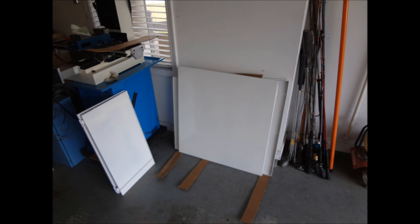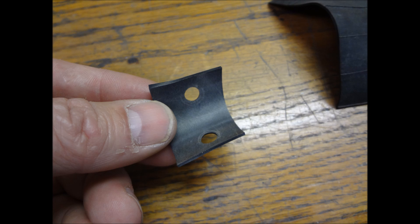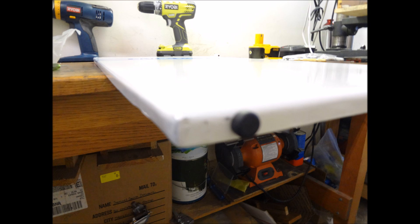This here is an inner tube from a bicycle. I cut some one-inch by one-and-a-half inch rectangles, folded them in half, and punched a hole with a hole punch. I used these as gasket material for the side panels where the bolt holes went through, so that everything would seal up nicely. I also installed some rubber bumpers on the bottom of the door — just drilled a quarter-inch hole and the bumper popped in. This keeps the door from rattling and does a really good job of keeping it in place.